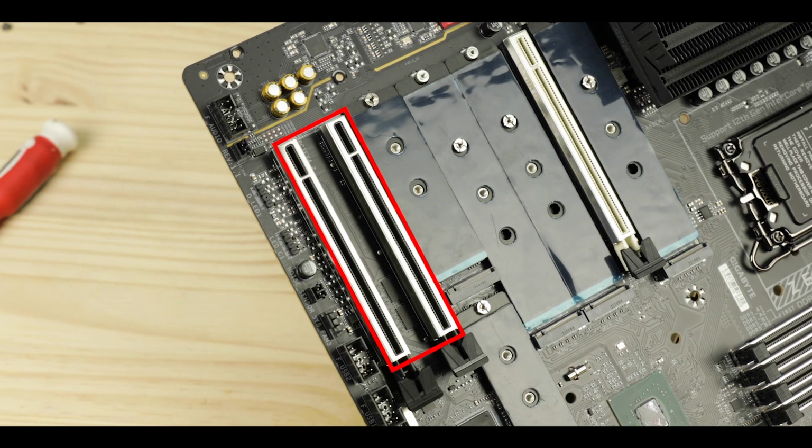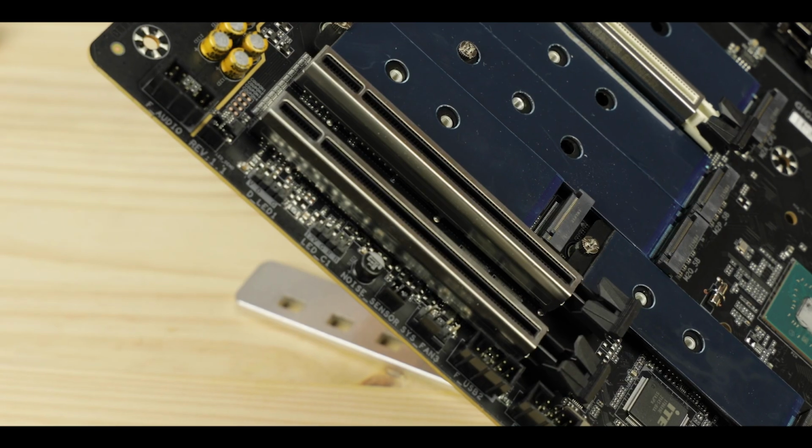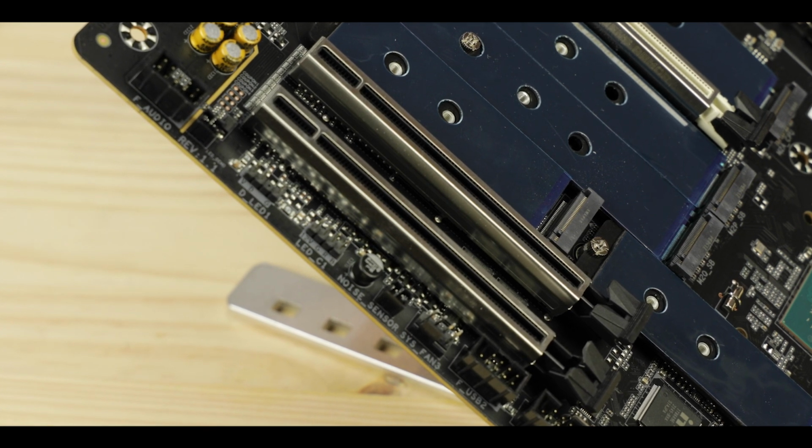The only issue I have here is yet another marketing stunt that AORUS tried. If you look at the other two x16 slots, they cannot properly support video cards. I mean, if you put a video card here, it will be bottlenecked by the very slow 4 gigabytes per second bandwidth. But still, GIGABYTE decided to equip them with metallic reinforcements, which suggests the idea that they can support video cards and gives that multiple premium GPU impression to the board. I find it a little bit dishonest. It's also spending some of our money for absolutely nothing again. And it's not the first time I'm saying this about AORUS GIGABYTE, which I love. But yeah, this is something I would like to see disappear on the next iterations of those more premium motherboards.